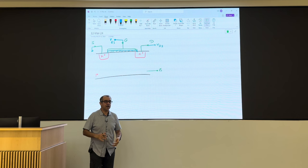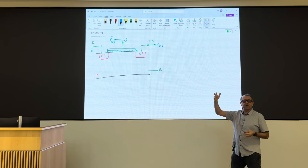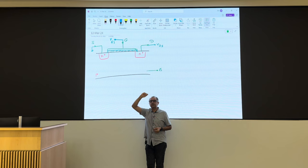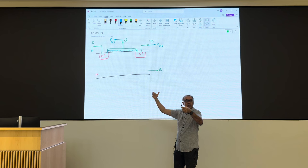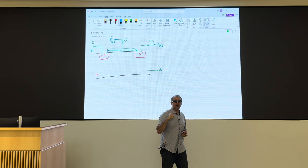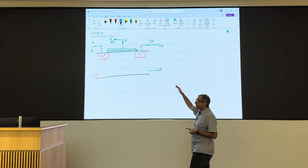If you raise the gate voltage beyond a certain value, we call it the threshold voltage, then you invert the type of doping right close to the surface. So if this is a P-type substrate, you inverted the doping type close to the surface, virtually, not really, meaning that we have more electrons than holes. And then because we have two N regions at the end of the channel, we have N plus, N, N plus, you have a resistor. And the value of that resistor we could control by applying that voltage to the gate. So you had a variable resistor, that was nice.